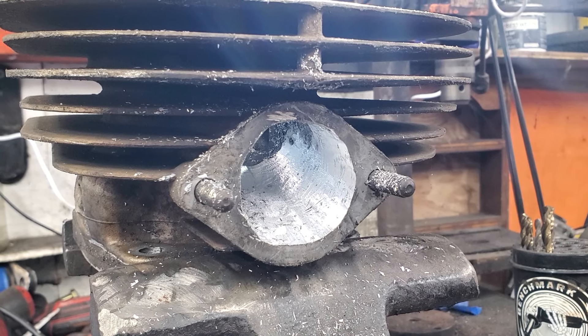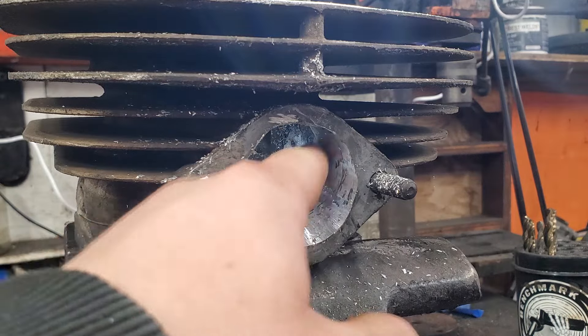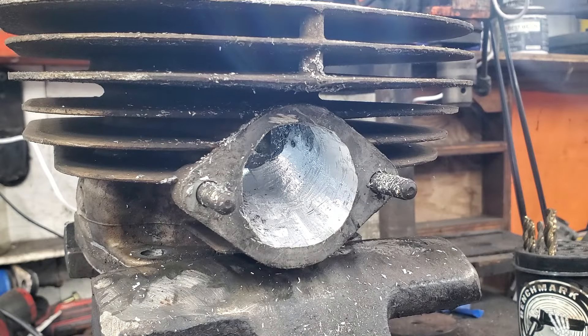Well, I'm going to call it a video — that's pretty much what I got to do. I got to burr some more. It's doing a heck of a lot better job than the steel ones, but that's kind of my fault because I was using a steel burr on aluminum and that really doesn't work too well. It was working, but it was burning the burrs, it was smoking, and it wasn't cutting great.